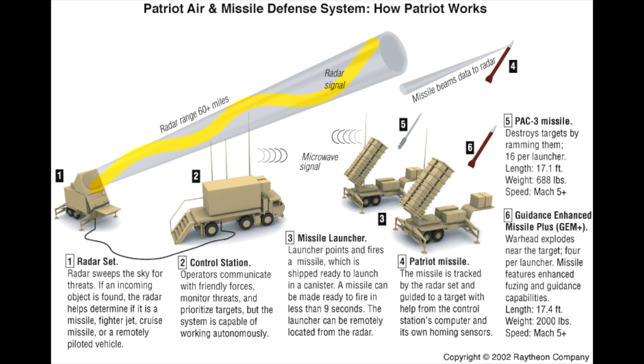Your focus will most likely go toward that element hiding beneath the directional antenna, which is going to be detecting the gigahertz signals. You've got the high band antenna — which from a wavelength standpoint is of course smaller — and the low band antenna with a larger diameter. There's a non-electromagnetic-blocking material, most likely some sort of bakelite or different plastic, creating a window to pick up signals. Basically, whichever direction you are facing, you are picking up the signals and can tell where your radar station is located.